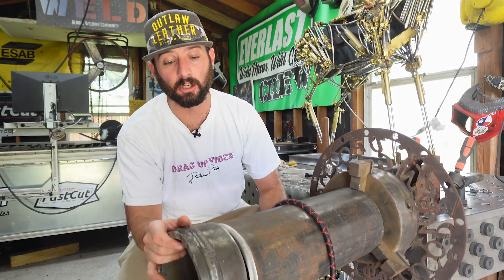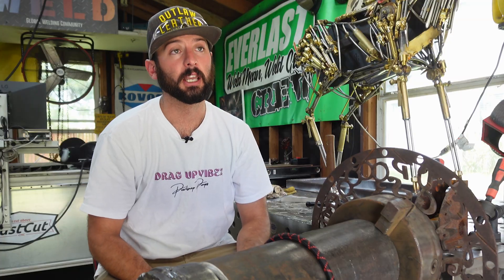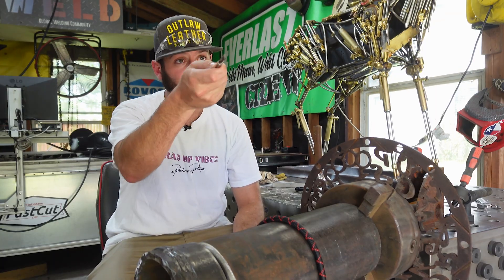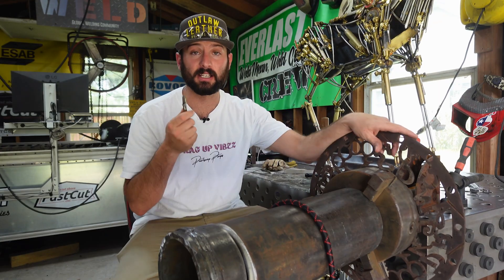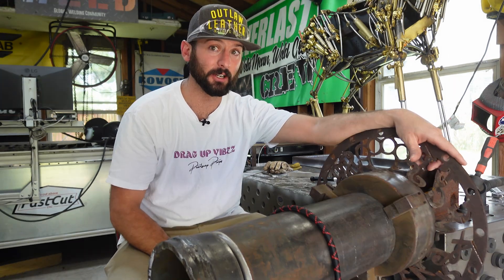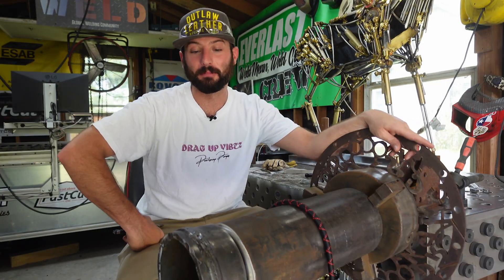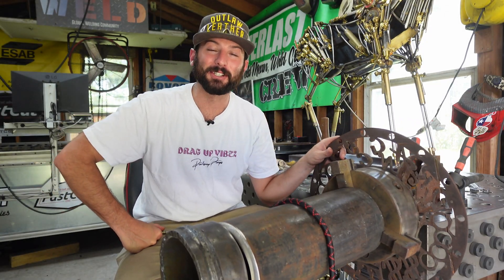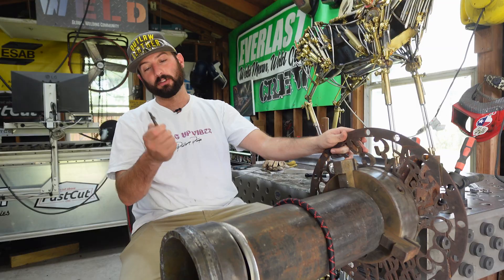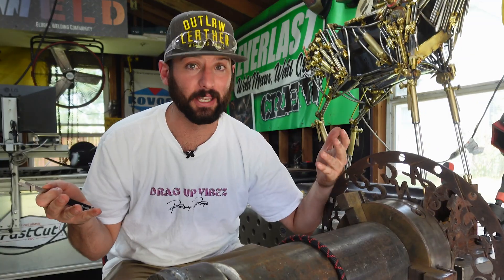With this much high-low, a welder should not even touch that. Call quality control over and say, 'Hey, check this out.' If quality says the fit is okay to weld, then it's okay to weld. If you're not comfortable welding it, you better speak up or you better try your damnedest. And that's what this video is going to be about — we're going to try our damnedest to put a bead in this piece of pipe with as much high-low and gap changes, and then walk you through how we get it in.